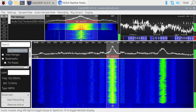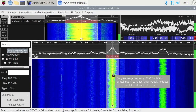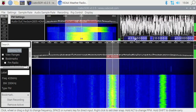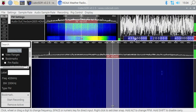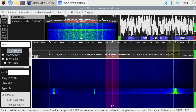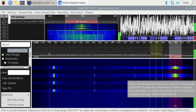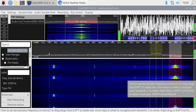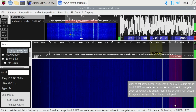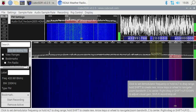Another thing you can do is detect radio signals. An easy one is 433 MHz — I'll type '433 megahertz' and hit enter. I have a little key chain that controls an outlet with a lamp plugged into it. If I hit a button on it, you'll see the frequency spike on the waterfall — right around 433.9 MHz. You can see me pressing it; it has an on and an off signal. This should also work with garage door openers and similar devices. If you had a remote and weren't sure if it was working, you could test it with the SDR — ideally test it when it's known working so you know what it looks like, and then test it again later if you suspect it's not working.